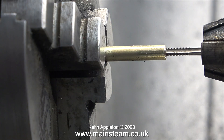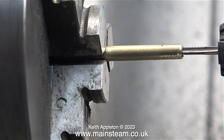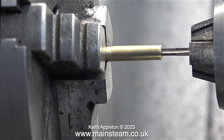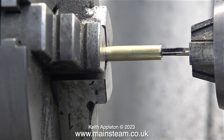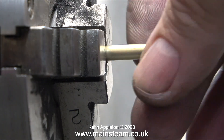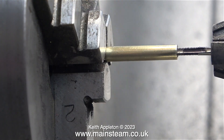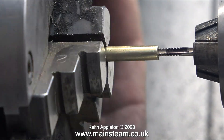Once I finished drilling all of the holes in the end of the brass bars, I threaded them all 6BA. What I'm doing is threading manually — you can see my hand on the chuck — but when I finish the job, I have the lathe in reverse, so I just engage the clutch and it retracts the tap. Once again, using a felt tip pen, I made a mark on the tap. This makes it so that the threads in the end of the bars are all the right length, and stops the tap from breaking off when it bottoms in the hole.